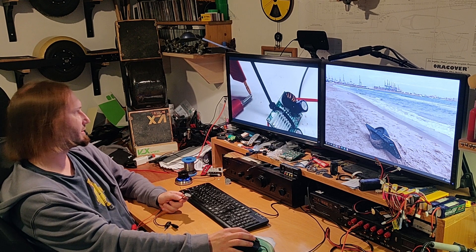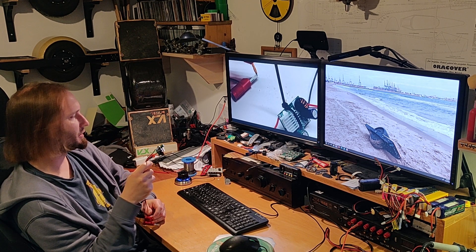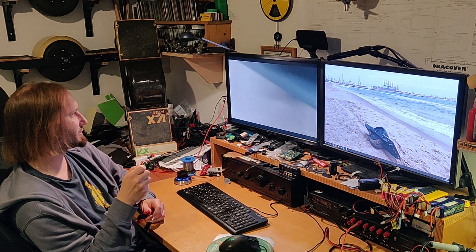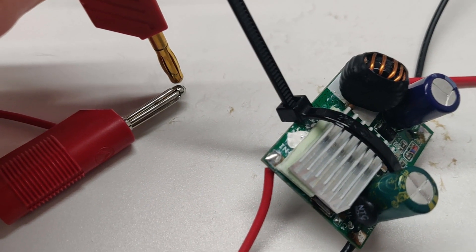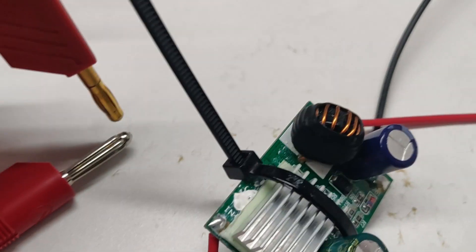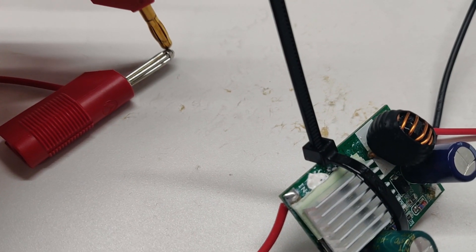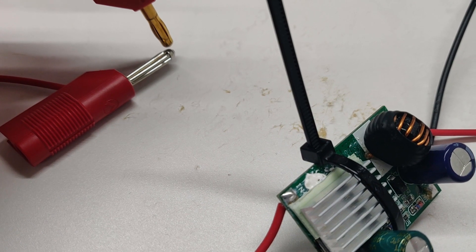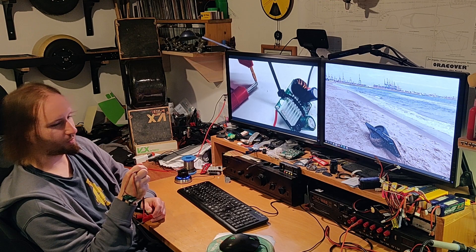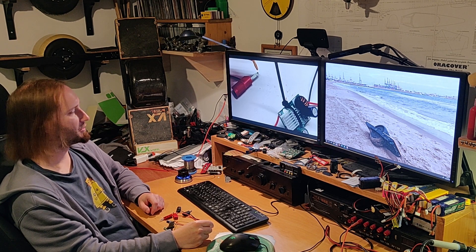For the very last test, I was planning to use a 5V relay powered from this converter to switch on the main supply. Let's see if the inrush current makes any sparks while connecting it to the power source. Well, hard to say if those sparks are going to kill the relay or not. There's clearly a little bit of high inrush current, but not as bad as expected. So I'm still not sure if I'm going to use the relay — maybe I'll use a MOSFET instead, so this won't be a problem.